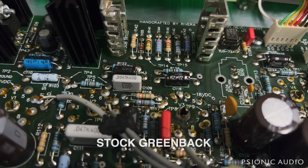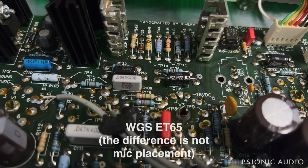I'm going to remove that damaged cap, and I can order a direct replacement. I'm going to look up the schematic and see what factors would affect that cap as far as current, diodes, other capacitors, etc., etc. So we've got a good place to start, but no real mystery so far.